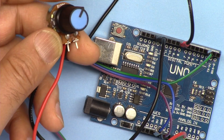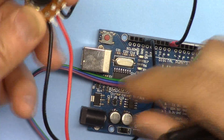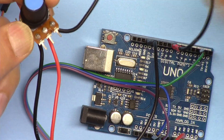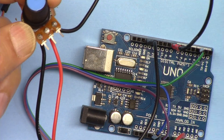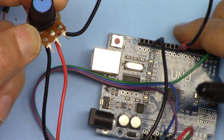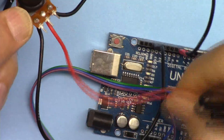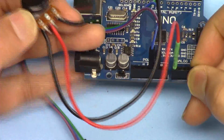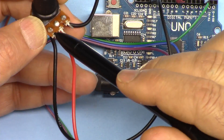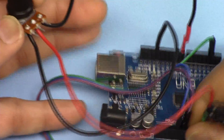For the potentiometer wiring, the potentiometer has three wires. The right wire is connected to pin 8, which is defined as VCC2 providing 5 volts. The middle pin is connected to analog 0. The last pin is connected to ground on the Arduino.